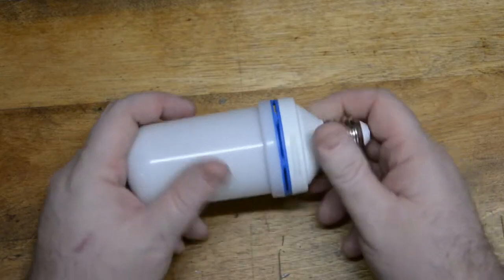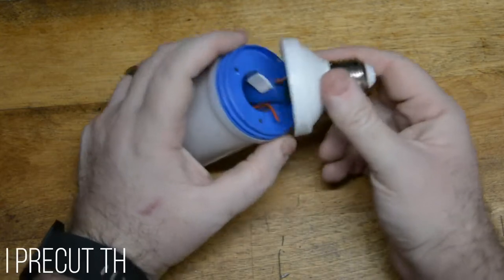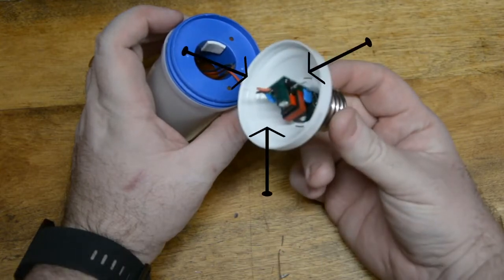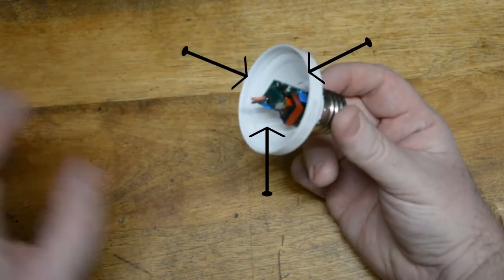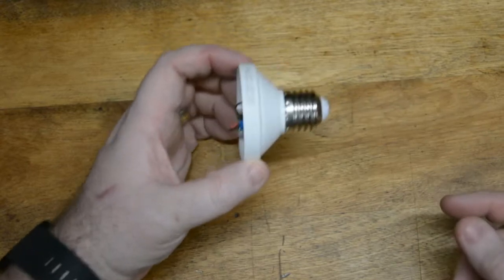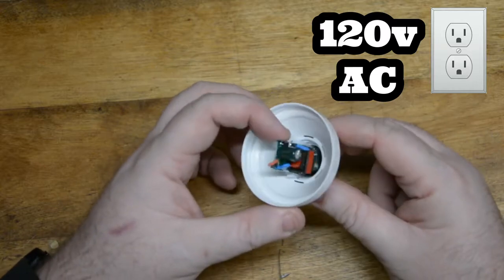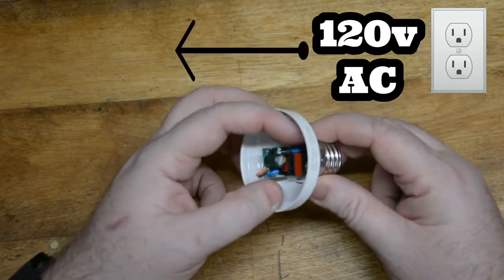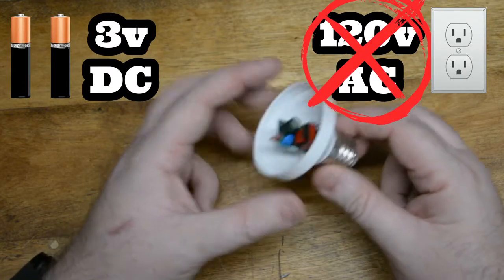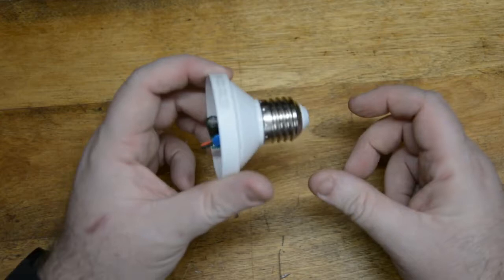Let's talk about getting the guts out of this thing. When you first crack open the bulb, which comes off really easy, you're going to see this little piece in here. This is kind of the crux of where a lot of this happens. We're not going to use this in the project, but it's important to understand. This whole thing is set up for 120 volts from your wall, but this piece reduces that voltage, converts it from AC to DC, and breaks it down to three volts. So you don't need the 120 volts — you just need three volts, which is why we can use two AA batteries.